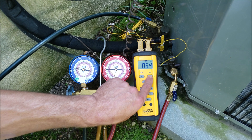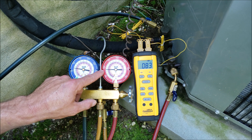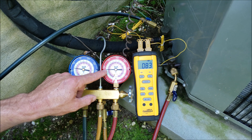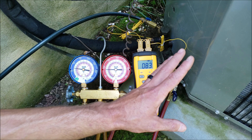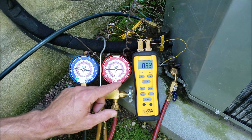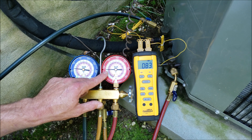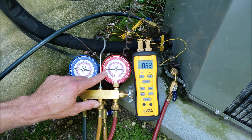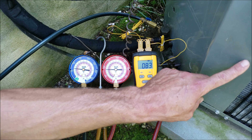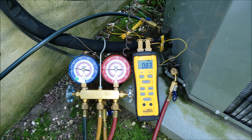Let's check the subcooling right now. Our subcooling — it looks to be 175 PSIG. We bring it into the green inner ring because this is an R22 system, not R410A. R410A uses the pink inner ring. So for R22, we bring our 175 PSIG into 92 degrees for the green saturated temperature in the middle of this condenser coil. 92 minus 83 and we're left with 9 degrees of subcooling.